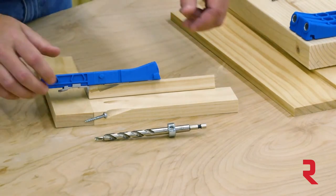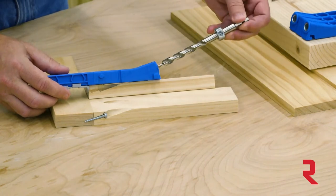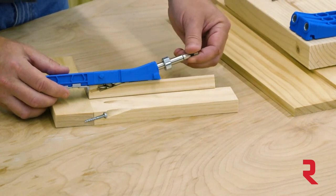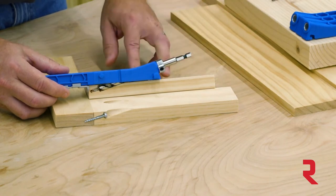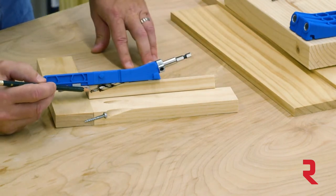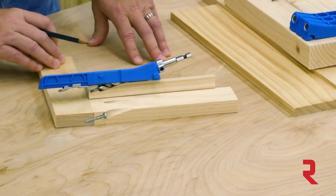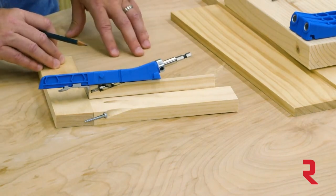You can see how it works in a cutaway. The drill guide holds the bit at the proper angle as it drives in and allows the tip and the main part of the bit to do their job. And the stop collar on the bit prevents the bit from driving too deep.